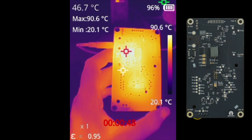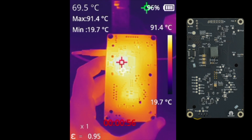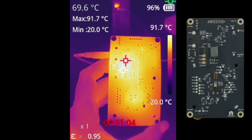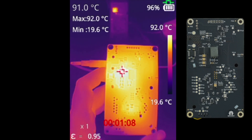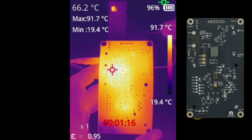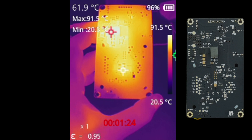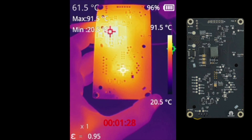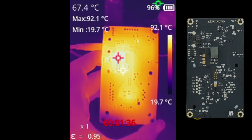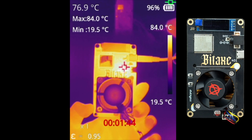You can see the hot spot on this side is just over 90 degrees Celsius. That's where we saw those two MOSFETs at the top that I pointed out earlier. Just underneath, using the white indicator, it's telling us that's about 70 degrees Celsius, 60 degrees depending on where I point it — so that's getting hot as well. Moving the white crosshair up, we can see it's getting closer to 90 degrees, 91. That's definitely going to be the hottest spot. The other spot with the white crosshair is at about 66 degrees — warm, but definitely not as warm. Interestingly, the white crosshair on the backside of the ASIC shows it's also pretty cool — about 60 to 62 degrees. So the hot spot is definitely right up where those MOSFETs are, and that's the area we're going to want to cool down the most. I presume that's also why we're seeing the extra heat generated on the front of the BitAxe as well.